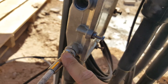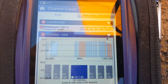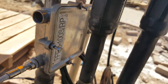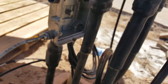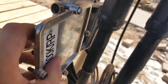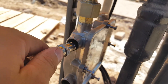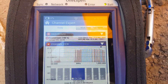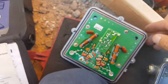Because if not, transmits will be way too low on these low-value taps. So I'm going to plug this in to the input of this - check it there - and our full scan does not indicate a suck out and it is gone. I've already pulled this thing out and checked to see if it was bad, and so far it's good to go. So I'm just going to swap it out with a new one and check the output - and it is gone, no more suck out. So there's something wrong with this equalizer.